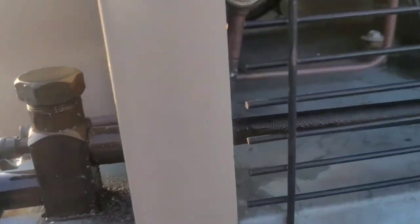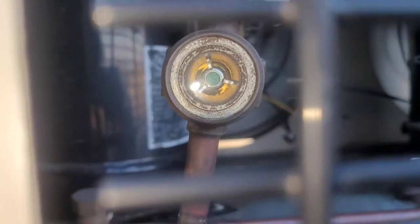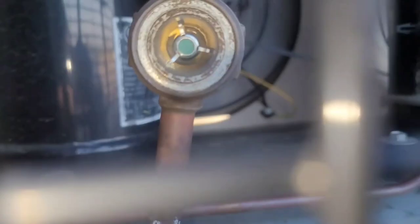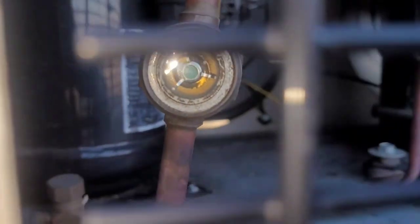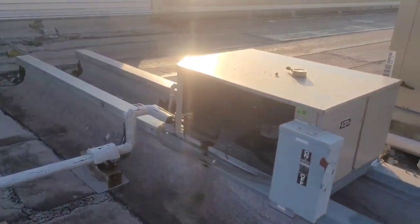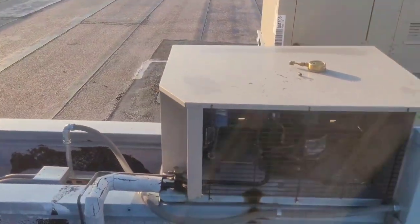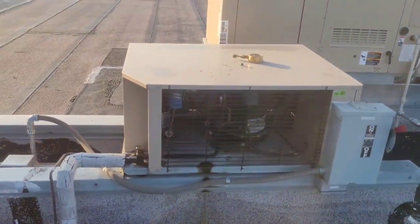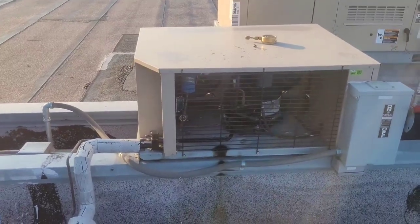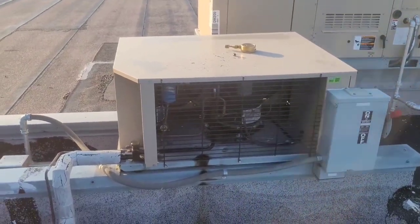Now I've turned it back on and it looks to me like it's exactly clear. So if it doesn't clear, you probably have a refrigeration problem. Why is it freezing up on just one side? I powered it on and it ran for like a minute or two and then it shut off. Put my gauge on it and it's pumped down, so the valve or the solenoid has closed.